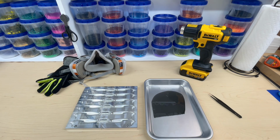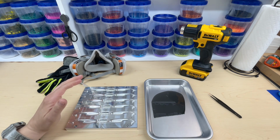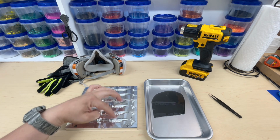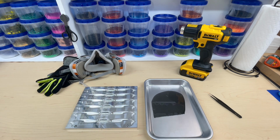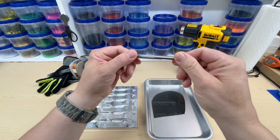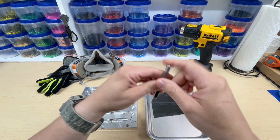All right, everybody, for our last color, we're just going to do like a plain white on this slouch mold, but with a twist. We are going to put kill dots in this mold and then inject it, or shad dots, however you want to say it. So I got my trusty leather punch here, just a cheap leather punch that I got on Amazon, and it is a 3/16, and it's simple.